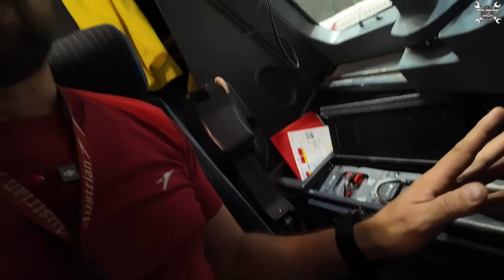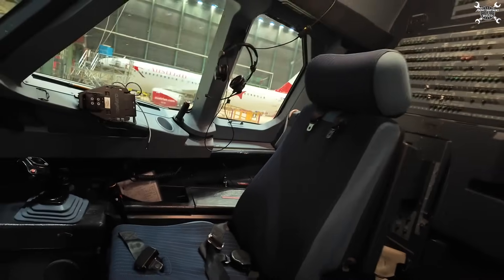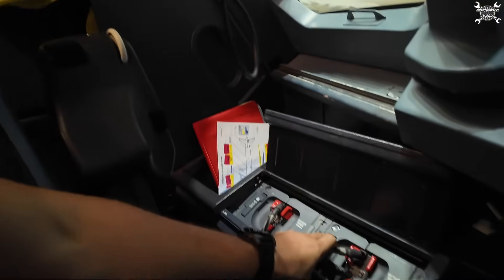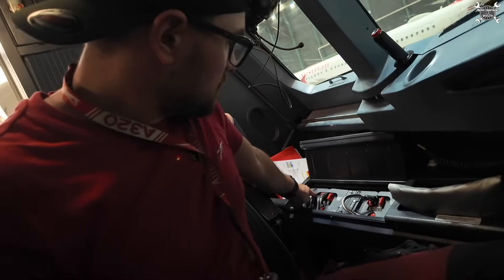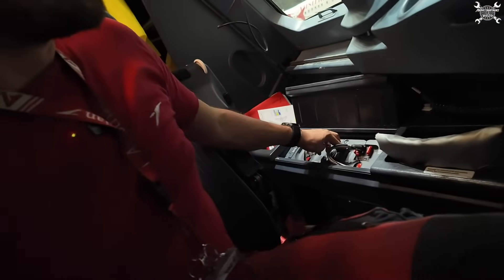In this airplane we have a mask for the captain, second occupant, first occupant seat, and co-pilot. We need to release this pressure by pressing the test button. That actually bleeds the line from the bottle all the way here to the cockpit. Once the pressure is released from the masks, we can move to the other side — to the first officer. Same.